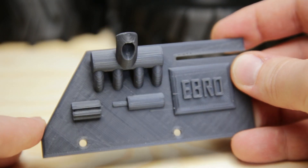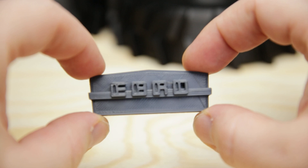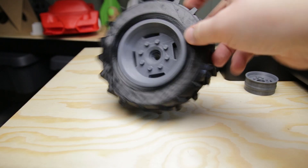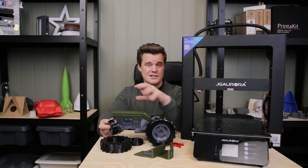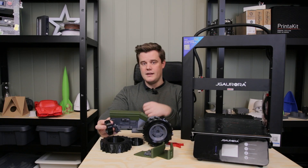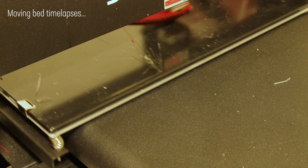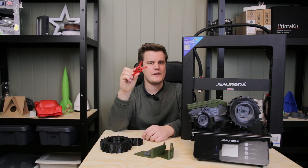These sides are really nice — they could use some ironing but I haven't tried that much in Cura yet. This tiny part was printed at 0.05mm layer heights. For big TPU prints I would not recommend this printer — Bowden extruders require more work with retractions and stringing. If you're going to use different types of materials you may have to fine-tune settings per manufacturer. I also printed quite a few PETG and CPE parts, and those work really well, though retraction and stringing with co-polyester is something you have to fine-tune.